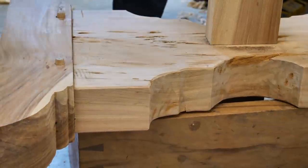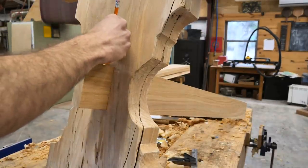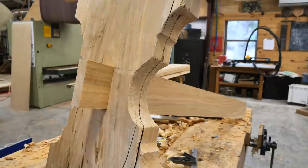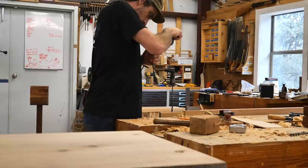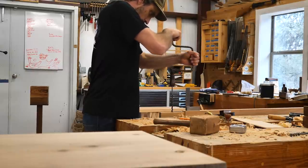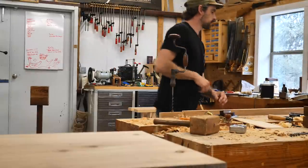So I seat those shoulders up and now we're going to mark off the edge of that tenon. It's coming out about three inches. It's going to give us enough room for that top wedge to come down through the tenon and so we've got to mark it to know exactly where to place the mortise for that wedge. I'm going to do this by hand. Now this is an incredibly difficult point to drill here because you've got a half inch bit on a one inch tenon — so basically you've got a quarter inch spacing to the edge of your tenon, if that makes sense.